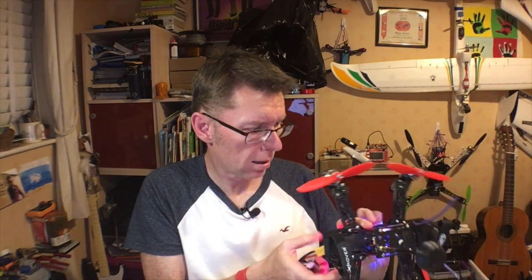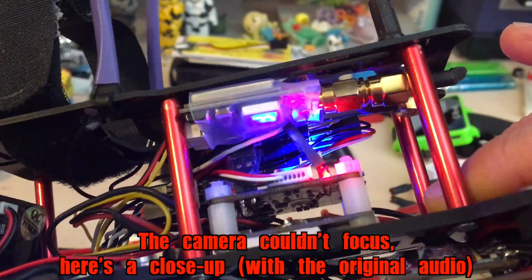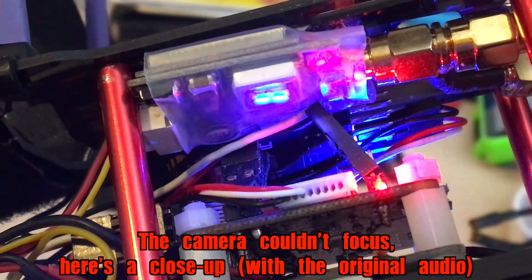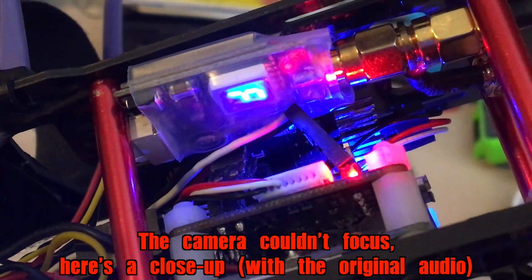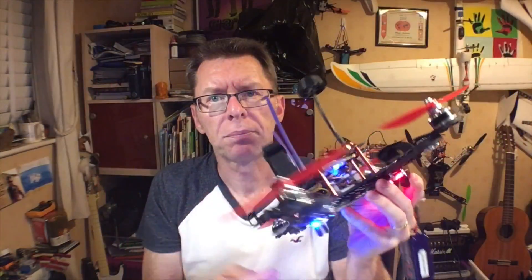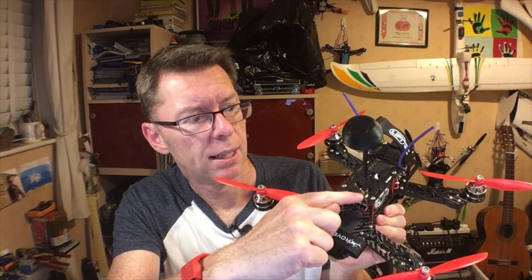If I plug in, you should just see under there a number. It says F1. Now this VTX is on RPSMA. What I've actually got is, because I don't have many RPSMA skews, it goes to an RPSMA to SMA adapter onto a pigtail and then up here out of the frame onto this big nose skew. But we shouldn't have any real losses there.